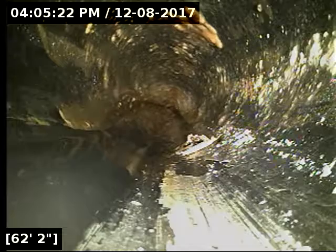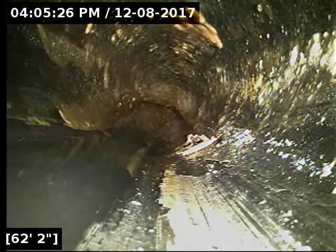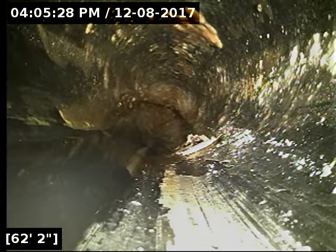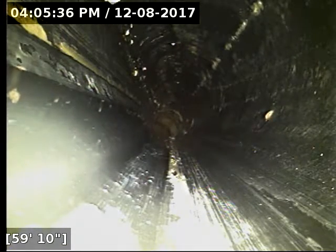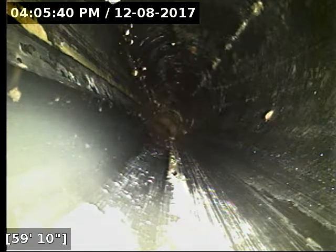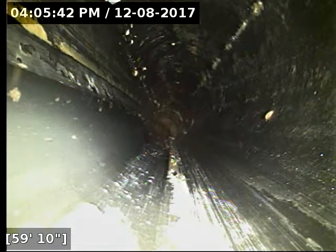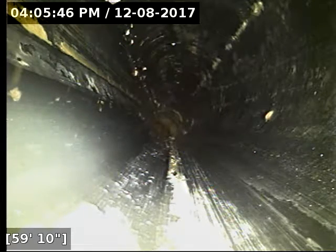It's as significant as a belly can get — all you can do is make the belly longer. Once you get that much water in there, it's just a big giant water plug in the line and everything has to make its way through, which is very difficult for debris to do. I do recommend correcting that. There's a vehicle parked over near that spot, which makes it difficult to locate all of it, but I was able to put a marking right where it starts. You just work your way towards the tank until you hit that 90 where it dives down.